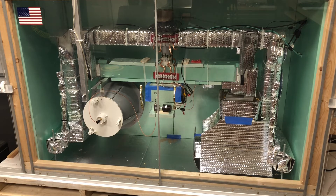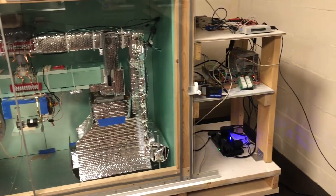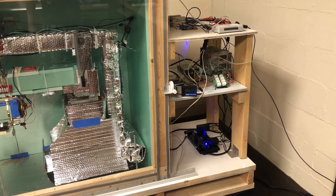The ADC is an analog to digital converter. Over here is the equipment shelf — 120 volt AC comes in here. I've got three different power supplies on the second level: a 30-amp 14-volt power supply which powers the main amplifier on the torsional pendulum, another 7-amp 12-volt power supply that powers all the other miscellaneous stuff like the relay board, and a laboratory-grade power supply to provide power for the laser displacement sensors.